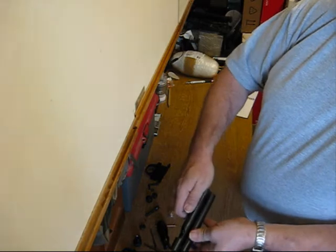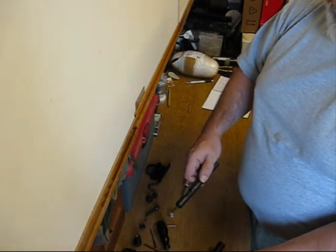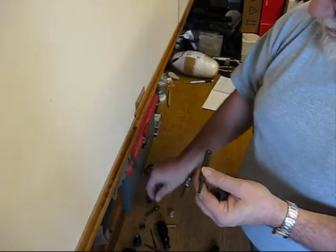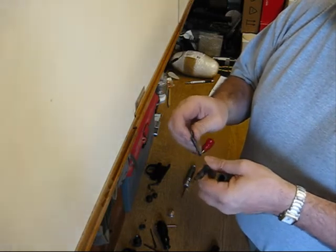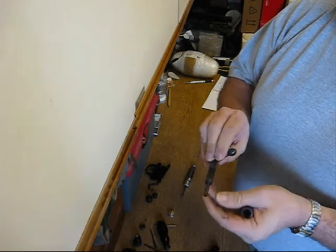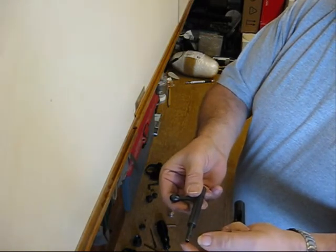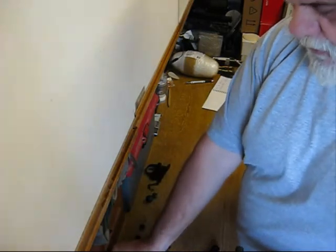And now the breech will just lift off of the 2 pins. Get that separate for a moment, and we'll just slide that out of there. This is the probe. Fundamentally, that's where the bolt goes in. That way up, actually. And the way this works is, when it's open, this is away from the gas tube. When it closes, that then allows the gas, when you pull the trigger, to release the valve, and the gas pushes the pellet out the barrel.